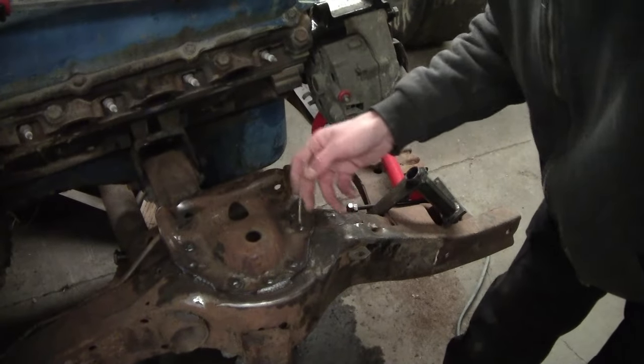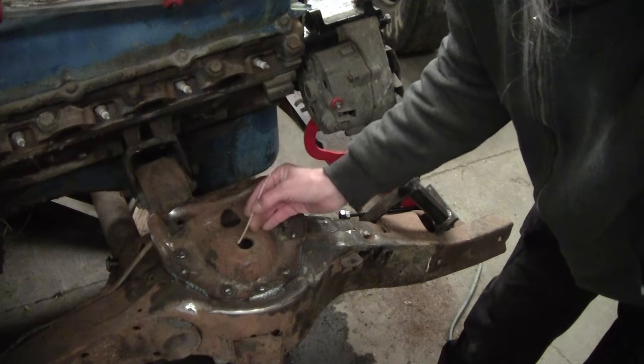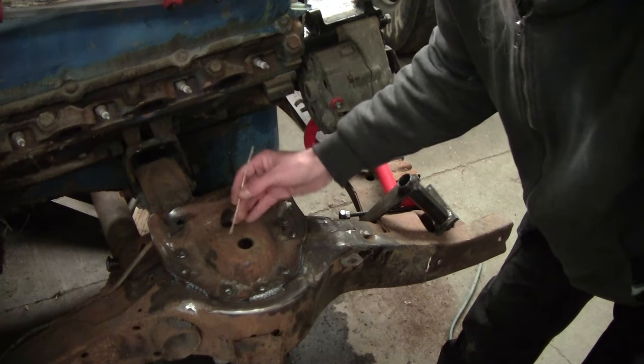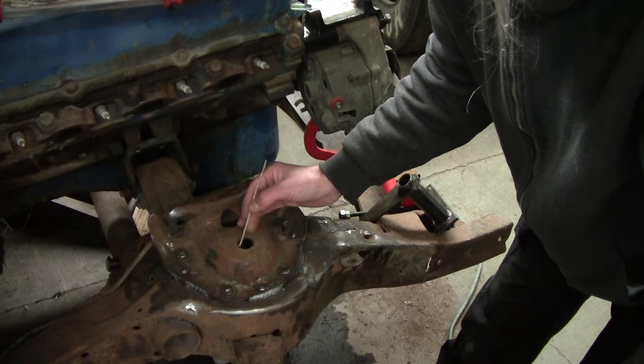Now, rosette is the exact opposite of that. You use rosettes a lot in body work, filling holes. That's basically what a rosette is. It's filling a hole. Now in a rosette, now I'll get back down here, I can show you on the hole. You do it just the exact opposite. You start on this material, but you start it out here on the edge of the hole. You give it a zap, you light that match and get it going.